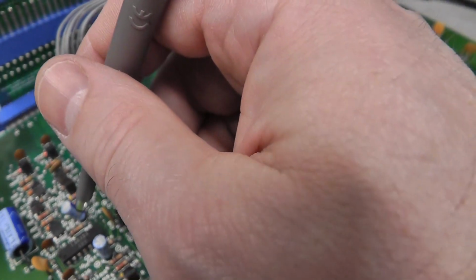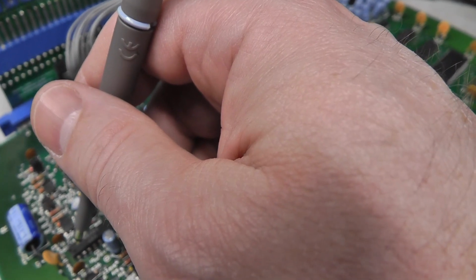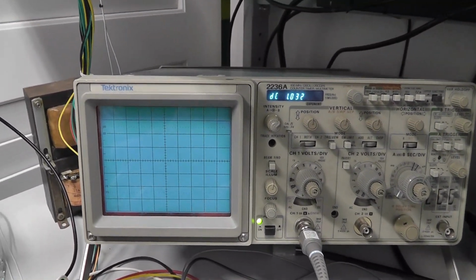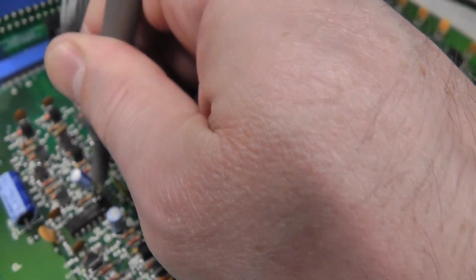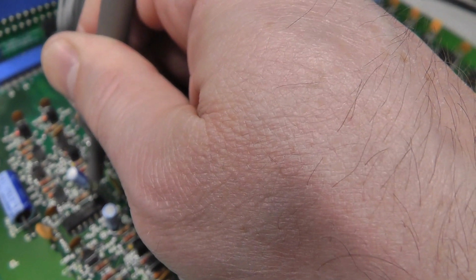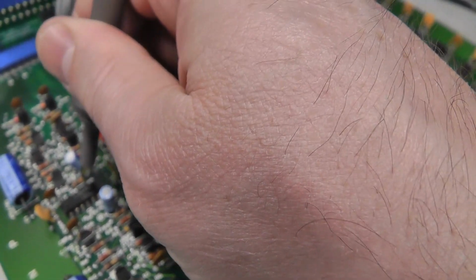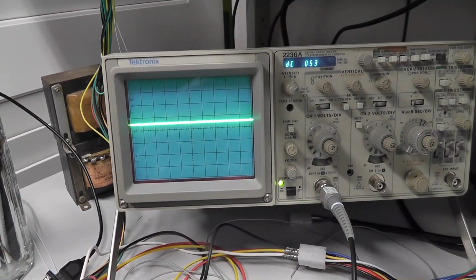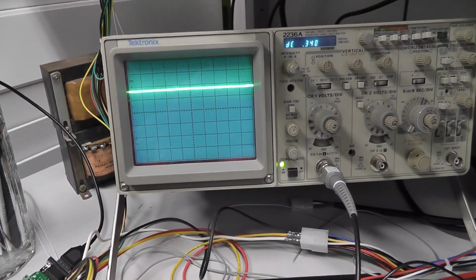And then on the red side, to compare it to something, we are at like pin 8. Pin 8, it's a little bit rusty, but you can see I have basically 10 volts on that line. And then on pin 9 I got 0.3 volts. Maybe the amplifier is working, 0.3 volts. Is it? That's pin 9. See, it's a little bit rusted, so I might replace this amplifier anyway.